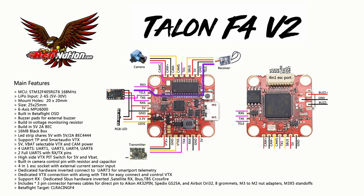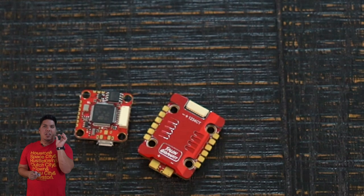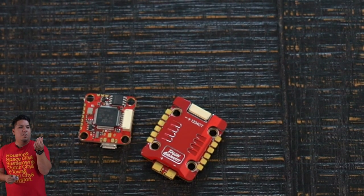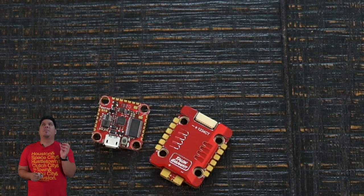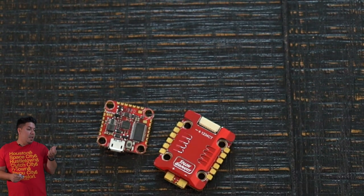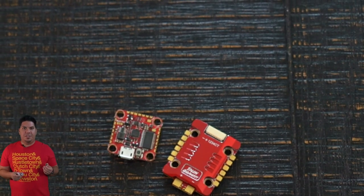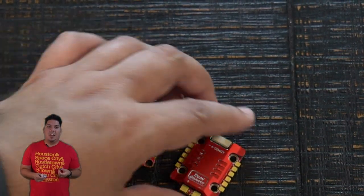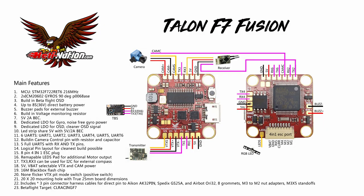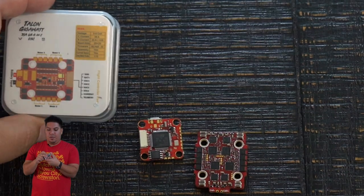I love that they're coming out with so many options. The pad layout is just so great, and on these version 2 boards they've changed it up. They used to have the standard big pads, which I liked, but now they're going with pads on the edge that have a notch — that notch means you can just sink the wire or seat the wire right on there. That is going to make for a clean build, easy to solder up. One thing you do lose is the silk screening on the board, which I do kind of miss, but it's not a big deal because you can easily look that up on the website and they have very clear diagrams. This particular Gigawatt ESC comes with a diagram on the back that shows you all of the wiring.